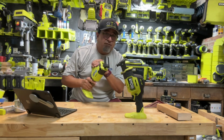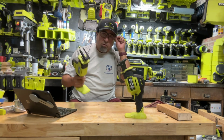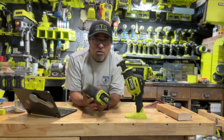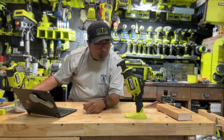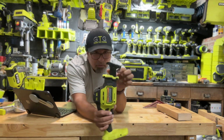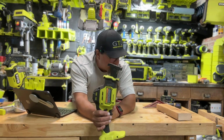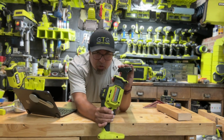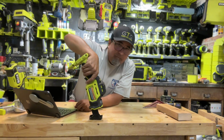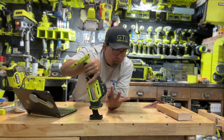And also, you get a lot of vibration when you have a shoe that isn't really supporting it a whole lot. Now, does this do the job? Absolutely, it does the job well. I've used this to cut branches, pallets of wood, other type of things. But I gotta say, if you take notice of the shoe on the new one, first off, it's much thicker. The pivoting point where the support is, is right in the middle. And in the demo that I'm gonna do here in a second, you won't see the shoe wiggle around and move around. It's stable. So when the shoe is nice and stable, so is the blade, which also means no blade jumping and very, very minimal vibration.